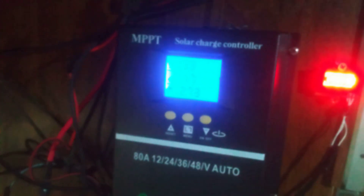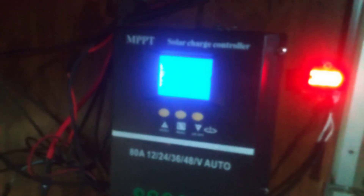I'm going to leave it on universal and leave everything where it's at. Right now I have my high voltage set to 14.8 volts because I'm using two batteries and I want to get the most out of the sunlight. While I'm getting my 12 hours of sunlight, it's going to push as much power as it can into my next battery to run my lights at night.